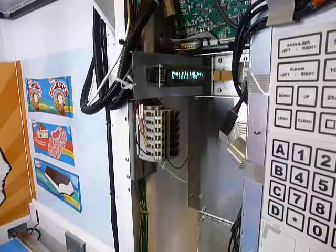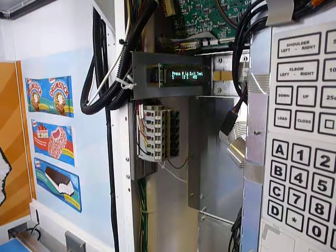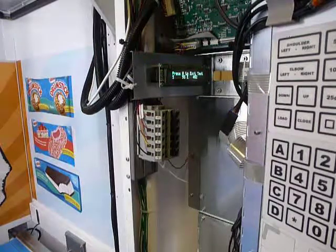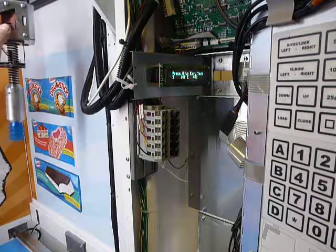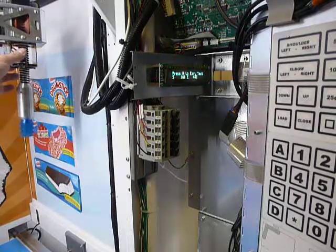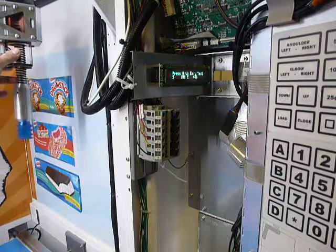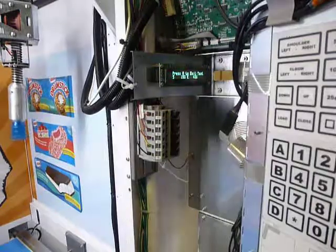The number can be anything. The important part is that when you move, like I'm moving the whole arm now, the shoulder numbers are moving. The elbow number might jump a little bit, but that's not when I'm moving. And the important thing is that as you move it, the numbers count continuously. If you saw that as you're moving it, it's just jumping between 150 and 160, let's say, and again, the number could be anything, that's no good. As long as it's counting all the way across.